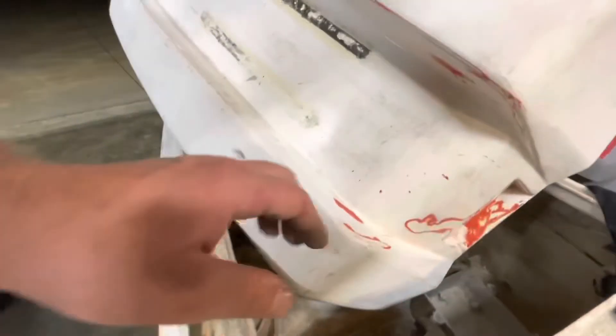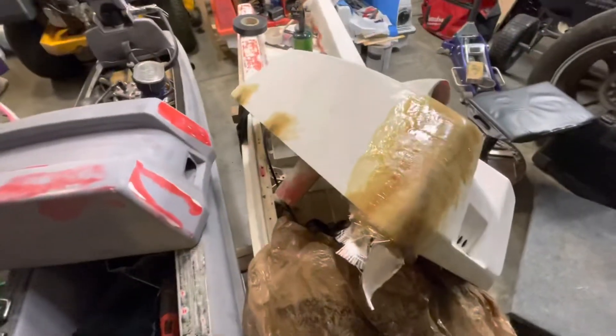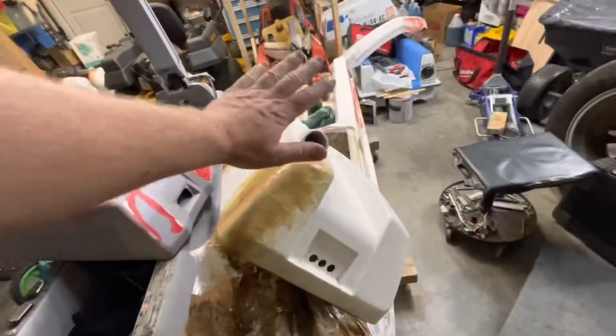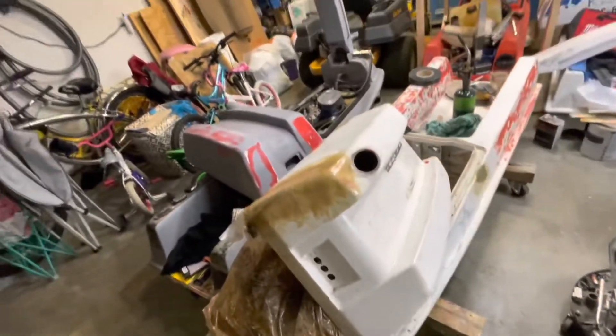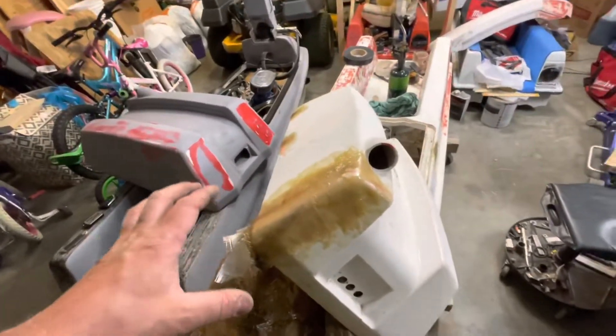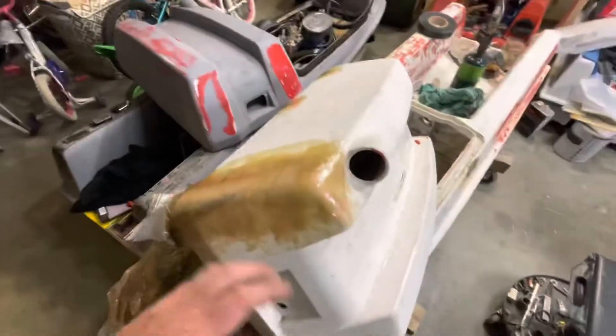That's the only fiberglass I think is needed to fix. This is how it's going to pass out — I'll have to do some sanding with 80 grit, shave all this down, fine tune it, and maybe just glaze it lightly with some resin to fill in any holes. What I figured out to get a lot of these bubbles out is using the propane torch, going over it really quickly a few times.